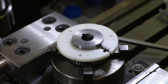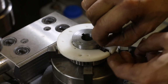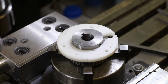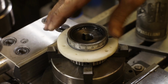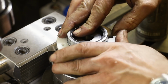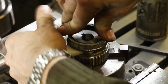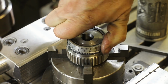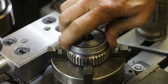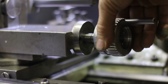The Colchester engineers designed the dial so that it shoots the steel balls and springs in 3 directions around the shop floor. First when disassembling, and several times in reassembly attempts. This plastic tool came in handy. The teeth could have been cut to the original knob too, but I wanted to preserve it in case this attachment fails.